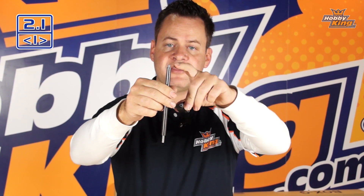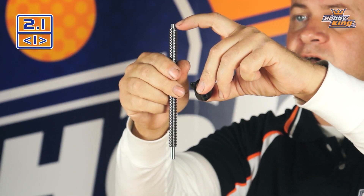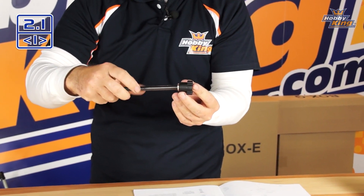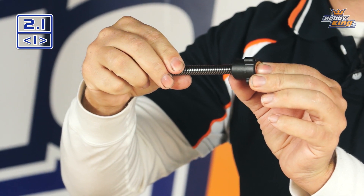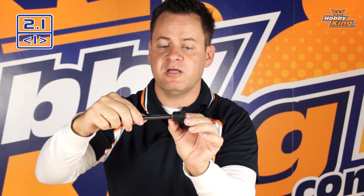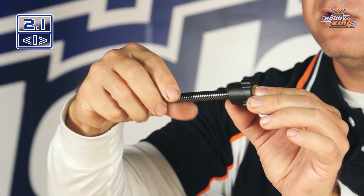Before threading the rod on, note that there's a top and a bottom. If you look at the rod, there is a thinner collar at the top and a thicker collar at the bottom. The smaller shaft end is the one we thread up from the bottom. Insert it and start threading — it should go in nice and smooth. When you feel it start to thread into the top collar, back off a little, push in on the spring to pre-load it, and make sure that brass collar is just barely exposed — not pushed all the way below the level of the plastic.